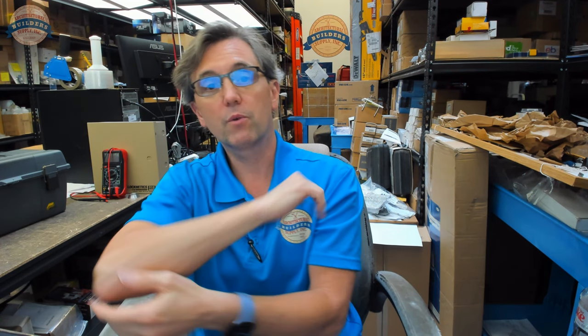patient area. So the 3 3/4 is nice because it moves that hardware a little bit further away from the jamb so that you can hit it with your elbow, hit it with your hand, your forearm, whatever the case might be. This kit is really cool in the sense that it does that. It does all four of those backsets. Will you ever drill a 3 3/4? Probably not. Could you end up getting into a job where you need to drill 100 of them? Yeah, I suppose. And you've got the tool to do it.